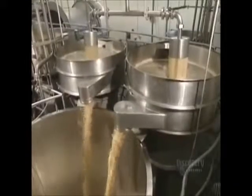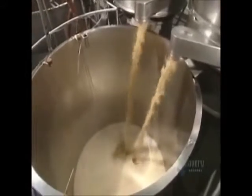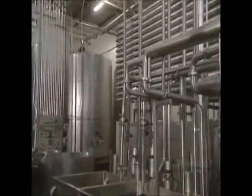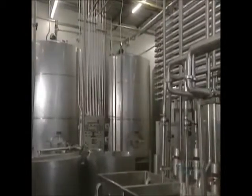The fabrication process continues. Juice flows from one stage to another via these immense reservoirs. The next step is pasteurization. Juice enters this exchanger at 22 degrees and is heated up to 88 degrees centigrade, then cooled back down to 50 degrees.